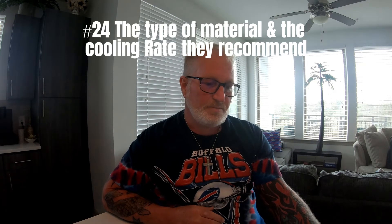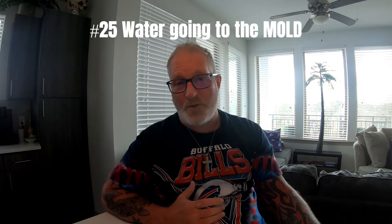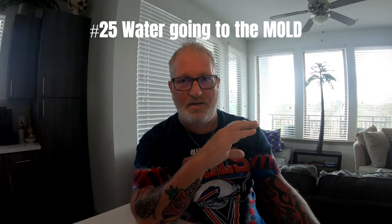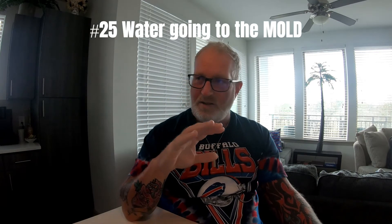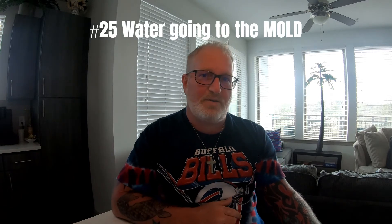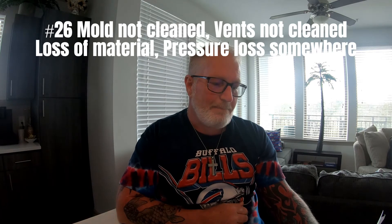Number 25: what helps to cool the plastic in the mold? Water going through the mold is what actually helps cool it. You might have straight water lines, lines jumped on the other side, or baffles running through. You might run one side hot and the other side cold — whatever it takes to get the part cooled down. For instance, running ST801 at 500-degree melt temperatures, you're trying to get it cold enough to come out of the mold more easily.